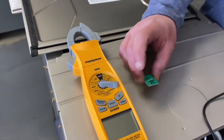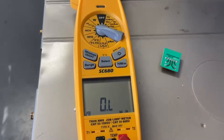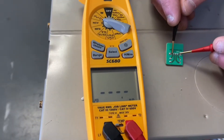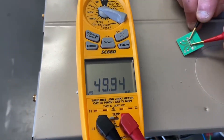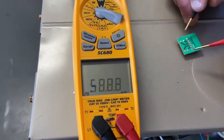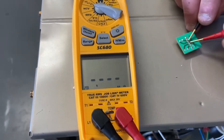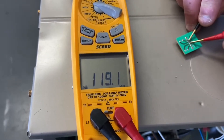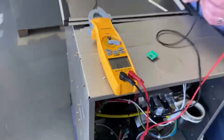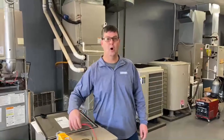The easiest place I found is to turn the pin plug over. To do this, we set our leads between one and four. You can see we're right close to 51, so we're good there on one and four. And on two and three, we're right there where we need to be — a little bit off, but that's not unusual with wire leads.